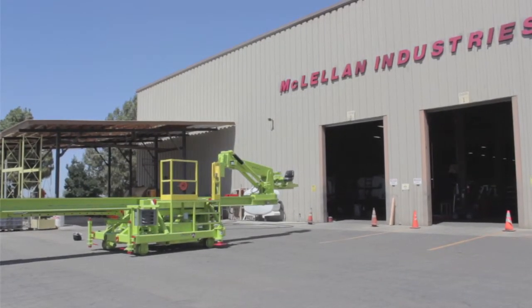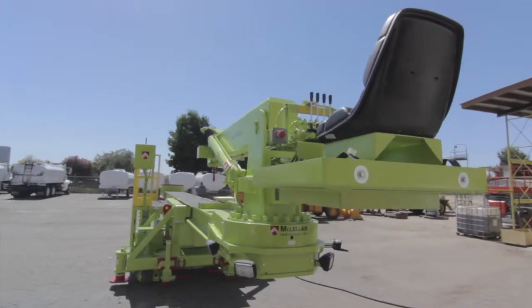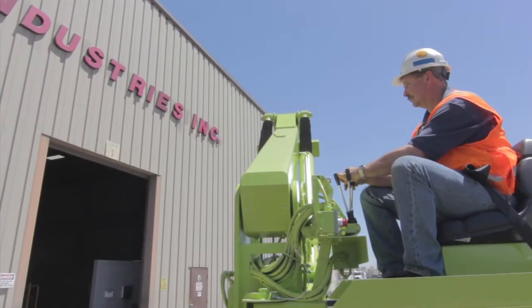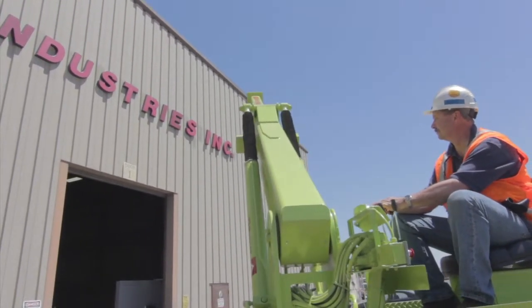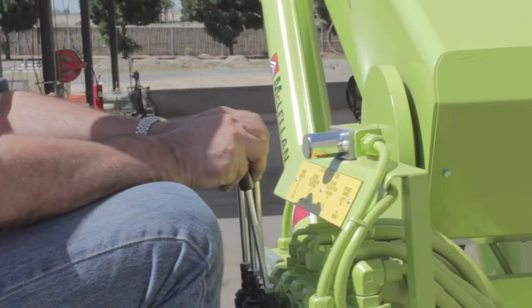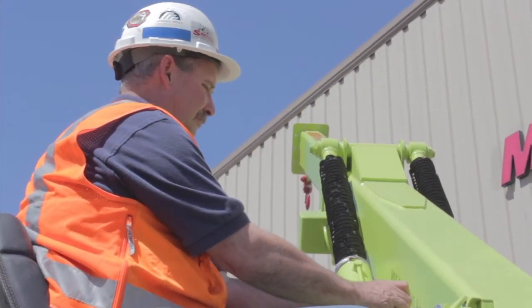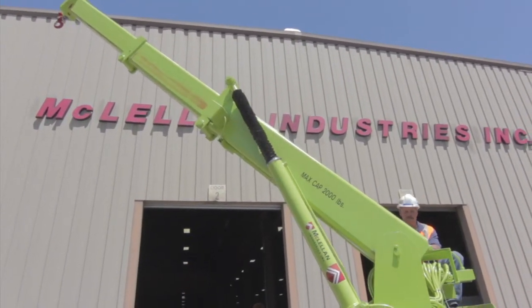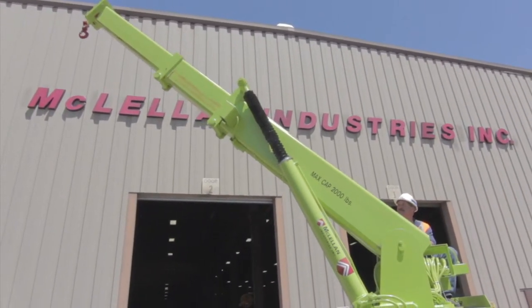This is a typical crane used on the McClellan three-axis liner handler. The crane is a three-section telescoping crane with internal hydraulic cylinders, dual lift cylinders, and 360-degree continuous rotation. This crane is equipped with a swivel load hook for slinging the liners. The operator controls include an e-stop, crane up and down, extension in and out, and rotation left and right. There is also a control for extending and retracting the main beam. The controls are full function, direct connected, and full metering for precise control.